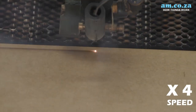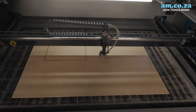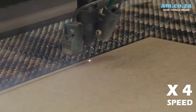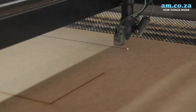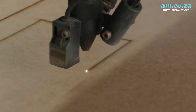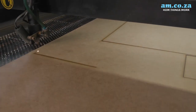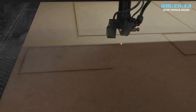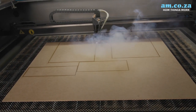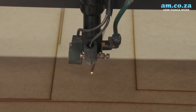The design that I had to do was based off a dog feeder's design. So basically the method here is to make sure that if you pour food in the top, it's not going to pour out all of it at the bottom. So in order to do this, we have to have a slant in our design, and make sure that the area at the bottom where the food falls is a much smaller area than where you poured in the food, to make sure that it's a constant feed through. When they eat something, some more drops through. And we're also going to make it a very small area for them to grab the food so that they don't sit in their food or vice versa, as per the customer's request.